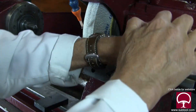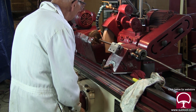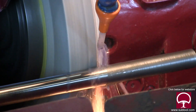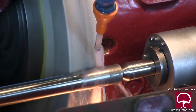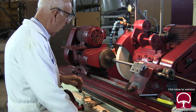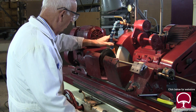Looking pretty good there. Now we're going to grind the shafts. This is the major shaft — we've already taken the taper out on this one and we'll show the other part. There are two shafts we need to grind. I like to take a rough cut. You can see the burn marks in there from straightening when it came back from heat treat — they straighten them out before we get them. So you can see it's not quite cleaned up. We clean that up with a couple of passes, making sure the taper is gone.